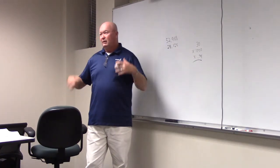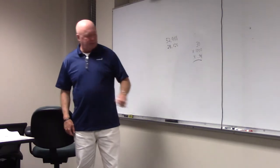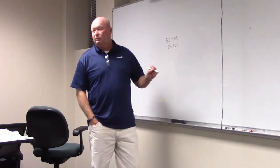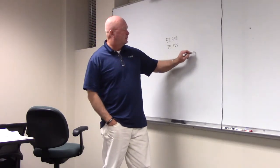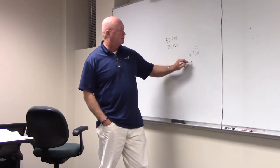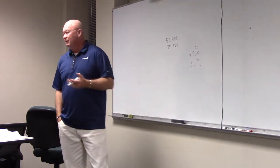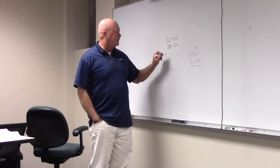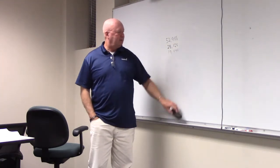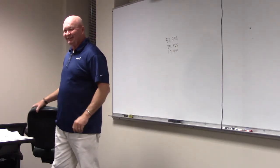Everybody see why we did this? Well, it's more than four. In apartments, you got multiple. If you got more than four, it's going to be more than four. Disposals, how many VA per disposal? 864. How many units we got? 30. So then what are we going to do? Multiply by 0.75. I know that doesn't look right, but it technically is. We're going to get 19,440. Y'all with me? We've got to get through this tonight.